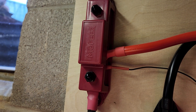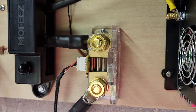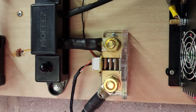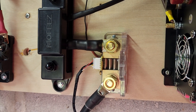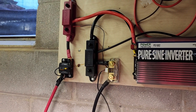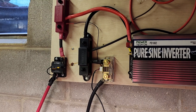The next problem is there's a small wire that goes from the positive terminal of the battery to the back of the shunt. If you mount the shunt the way I have it mounted — to the wall — that wire connection is on the back, so you have to take it off the wall to connect it. The terminal you insert the wire into is a hybrid between a clip and a screw.